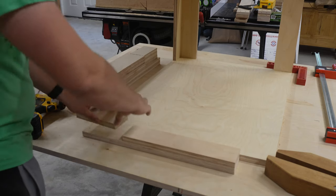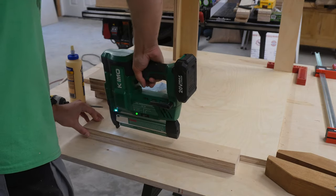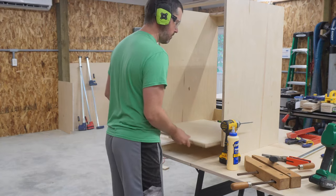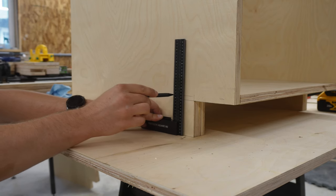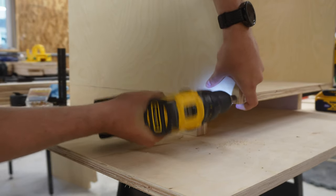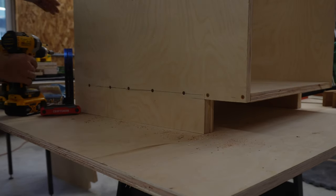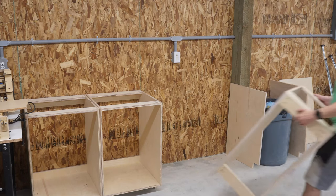For the carcasses getting drawers, I also installed some runners using pin nails and glue to install a bottom shelf. It's not fully necessary with drawers getting installed later, but if you're going to do cubbies instead of drawers you would definitely still do this step. Otherwise, you can maybe get away with just another strip or two on the top and the rear. With those runners in place, I just threw the bottom on there and screwed it in place.